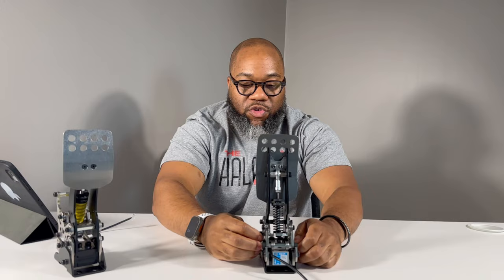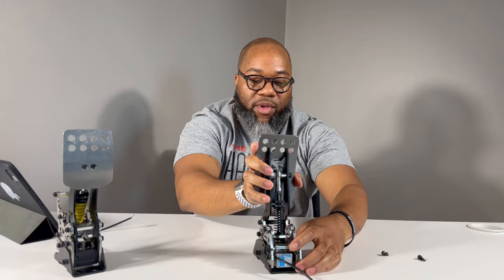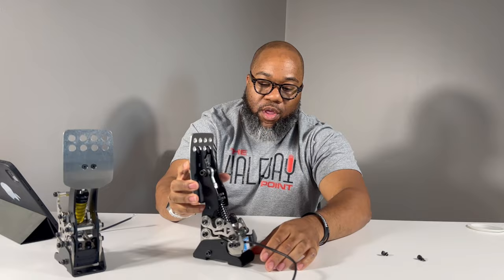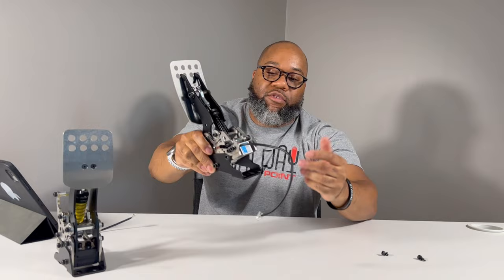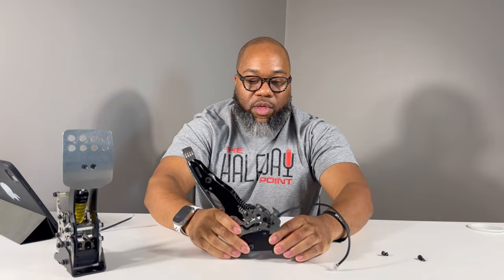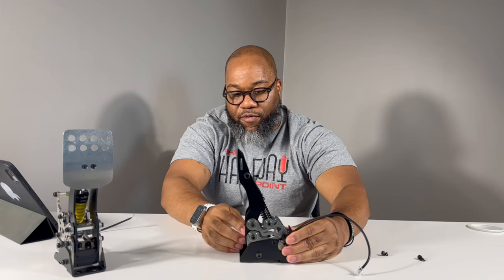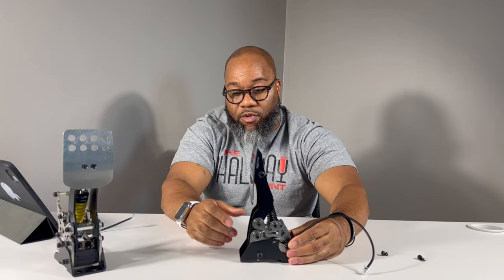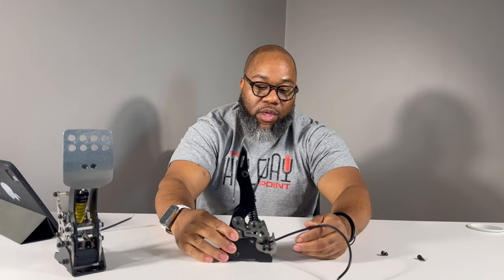When mounting, the best approach is to remove the top screws first, then mount the front. In its normal position you can get to the back screws, but if you tilt it forward you get a better angle to reach the mounting screws. Mount back to front, or front to back, whatever works for you, then put it back. You can see the holes that determine whether you tilt it slightly forward or keep them straight upright. To tilt it, you must loosen this screw first — otherwise it's solid as a rock.